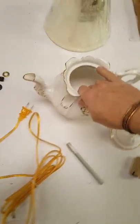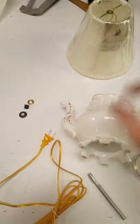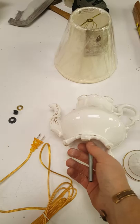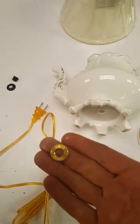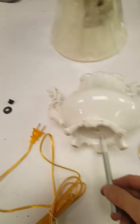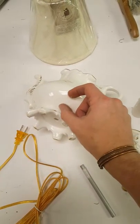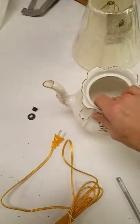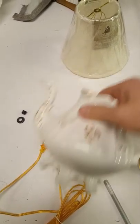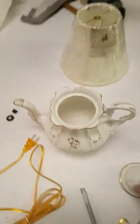One of the things I really like about it is that it's footed. Being that it's footed, I can drop the rod completely through it, tighten up my set screw, and then the cord will come out the bottom. If it was flush mount, I would have to drill into the side, do a coupling in the middle, and let the cord come out the side. Either way it can happen, but the great thing about the footed type is the cord can go either way according to your needs, and it's relatively attractive.